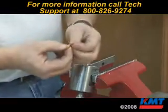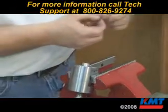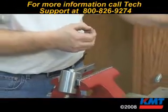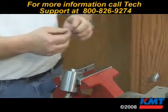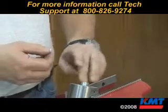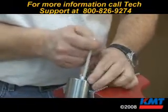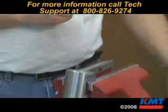Take our new seal with the brass wedge ring and the O-ring. The O-ring will be going down in there first. We want to use a little bit of FML2 grease on the seal. Position it down in. Use your push tool to position it down in there.